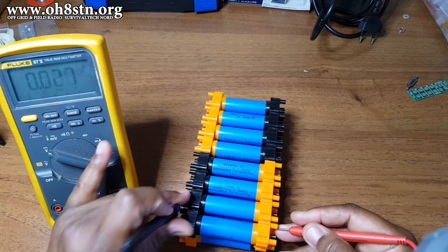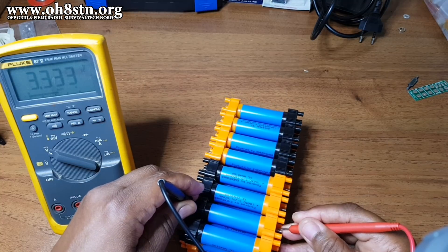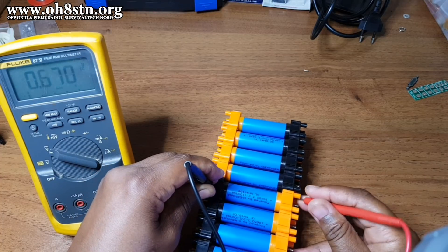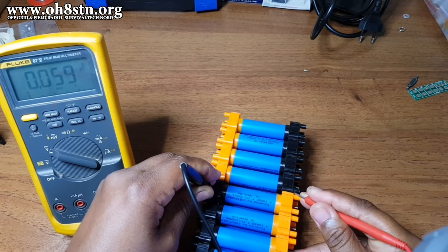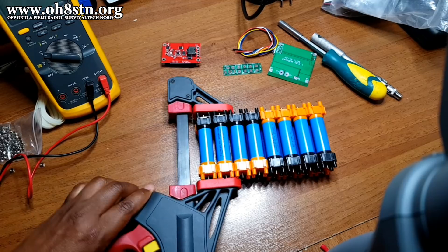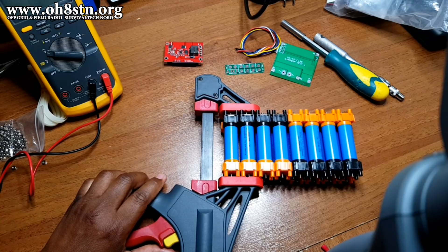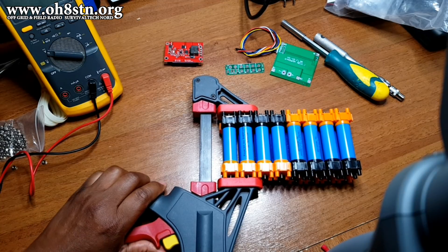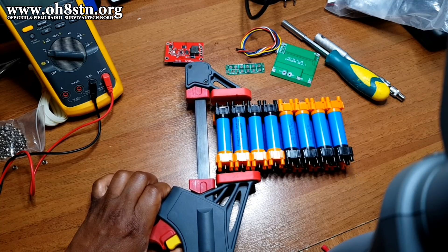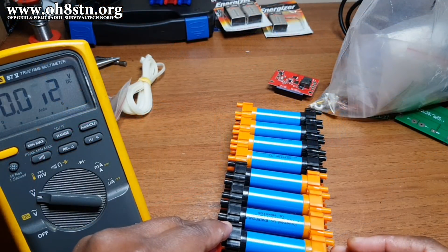Now we'll do a little quality control — we'll use our multimeter to make sure we have voltage on each end of the end caps. Later in the build, if there were any problems, this will save you time and effort. If you have some trouble getting those end caps to seat correctly, you can use a small hand vise applying very light pressure. Normally you don't have to do this because they go on pretty easily. After you're done, go ahead and re-inspect each cell for voltage on either side of the end caps, then we can move on.